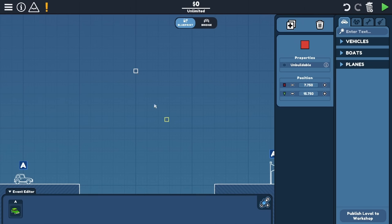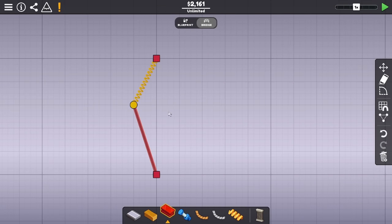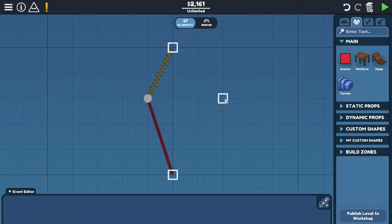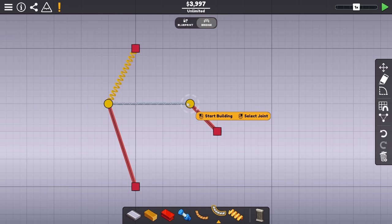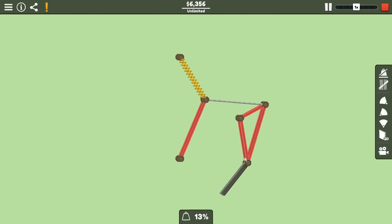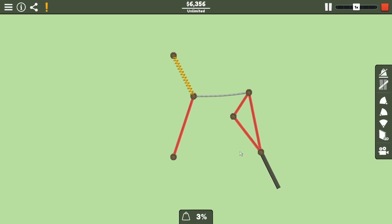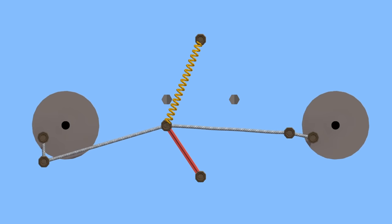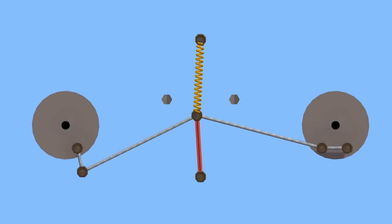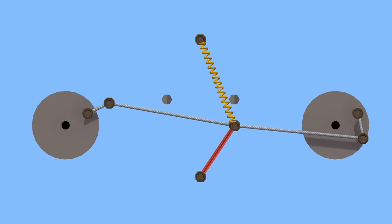Thinking about this problem, there was one mechanism that came to mind, and it was sort of the inspiration for me to try making a computer at all. All I have to do to make it is have a spring and an arm. If I try to pull on the center of this lever using a rod, you'll notice it snaps over to the other side, and now it gets stuck over there. This is why it's called bi-stable — it's either stuck on the left side or the right side, and if it tries to go anywhere in between, the spring will pull it back into position and lock it in one of the two available positions.